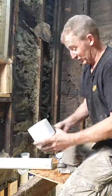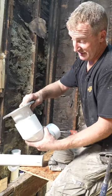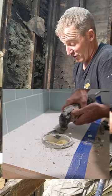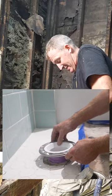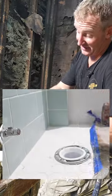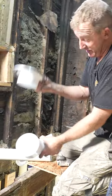It works really great for toilets because I'm able to get just a standard closet flange and it slides right into it. I can glue that in after I do all of my tile and all of my waterproofing. I really like that aspect of it and you're not reducing the size of the inner side of the pipe by doing this. It actually has a little bit of a bigger flow there.